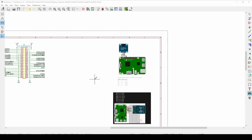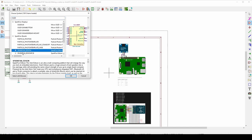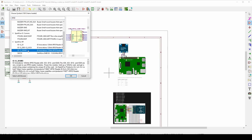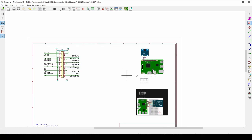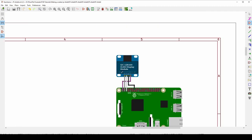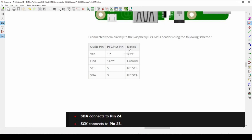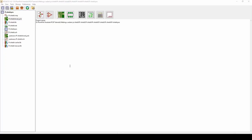I like doing this because it's a nice reference when you look at the schematic. We're not ashamed of using the internet — we want to build something we know will work because someone else already tested it. We're just changing the form factor and learning about PCB design in a fun, easy way. To place schematic symbols we push A, and you'll likely notice there's no OLED or NFC/RFID symbol in the default libraries, so we're going to make footprints for these components ourselves.